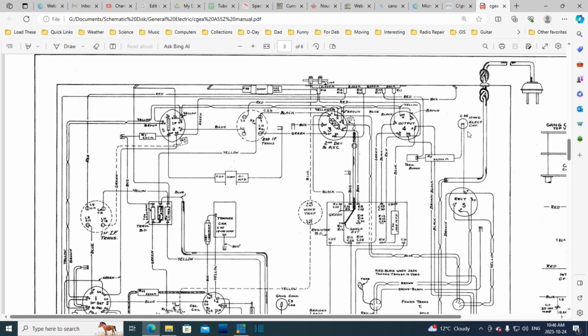I'm just going to look quickly myself at the wiring. So one wire, oh, this isn't done the same way, because one wire from here goes straight to the chassis. This shows it going to a pin on the rectifier. The other wire goes to a pin on the rectifier. So this is one wire. This one here, which is shown going to this resistor, is gone. This is gone, and they've just tied this to ground. Somebody has reconfigured the power supply in this radio. And remember, it has a low hum. Strong but low hum. Like a low pitch hum. Terminal board. Okay, so this is going where it's going, just like it shows, and this resistor appears to be missing.